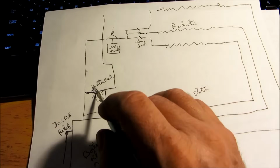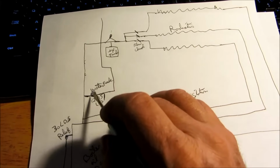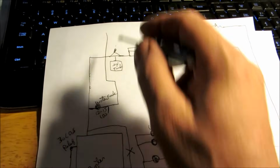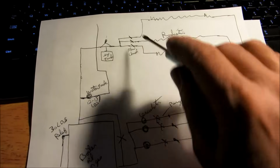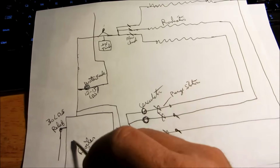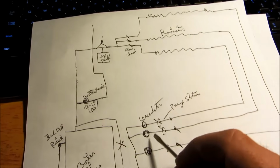Now, you can adjust this water feeder. There's a little locking nut on it. You can take that and adjust it up and down. When you flip that lever up, it basically pushes a pin down to allow city pressure through for purging. So once you get your zones all purged out, all the air out, you can open up all three ball valves, turn your boiler on, and on a call for heat, it would fire up and run the circulators.